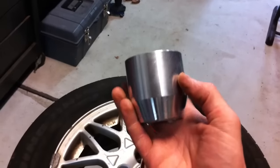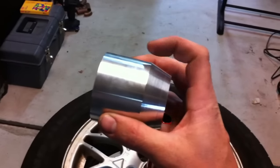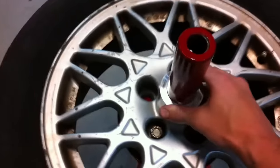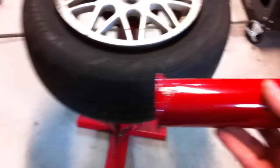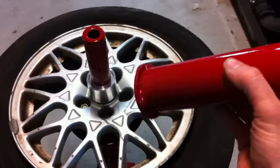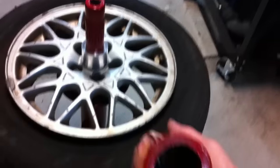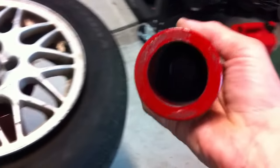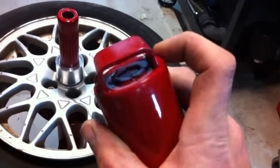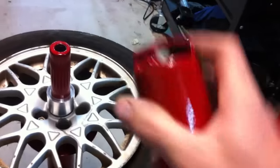I turned down a cone — this is just something I had on hand. I'd like to go a much bigger diameter with a steeper angle to handle a bunch of different sizes, but right now I'm just using it for Volkswagens and they fit fine. You drop it in there and that centers the wheel. I destroyed the bottom of this, so I cut a little bit off and welded on a washer that I had to bore out a little bit. The final straw was the very top where the Acme thread snapped. I was cranking down on it trying to hold everything because it kept slipping. I ended up grinding it off, re-welding, and welding that back on top.